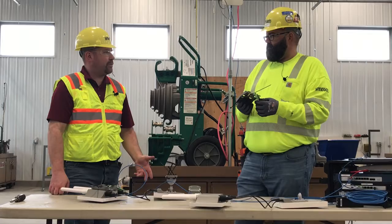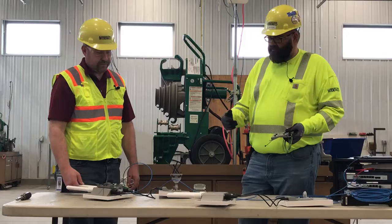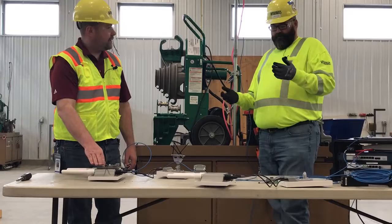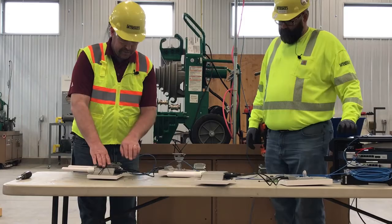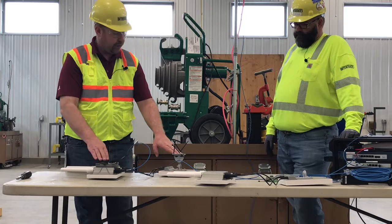There's a green ground wire on there — if we're in an environment where static could be a problem, I would recommend grounding the unit by connecting it to the conduit it's mounted on or whatever structure it's attached to. When you tear this unit out at the end of the job, make sure the brackets come back — we are unable to get replacement brackets for these. The watertight bushing is important too; if it's difficult to remove, feel free to cut the cable off and send the unit back and we'll take care of it from there.